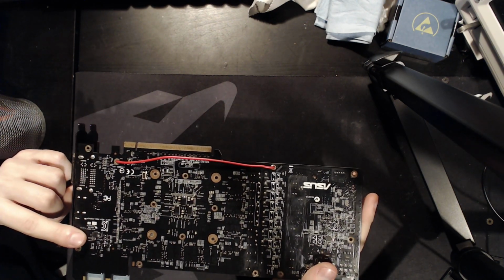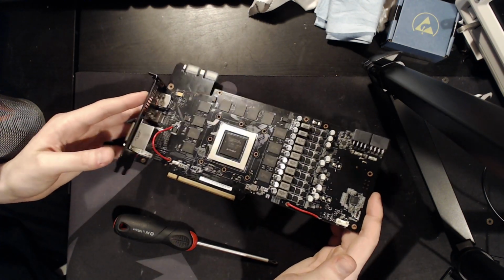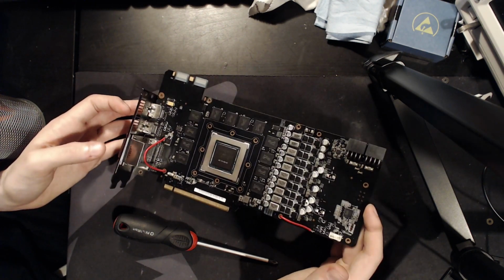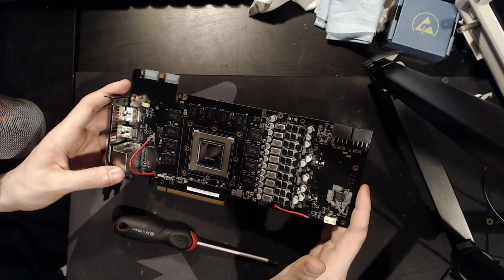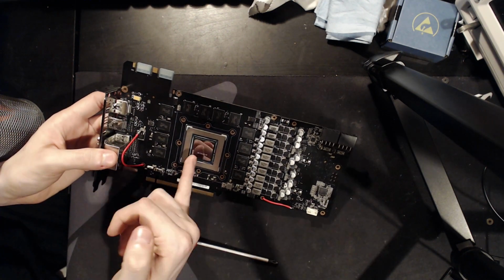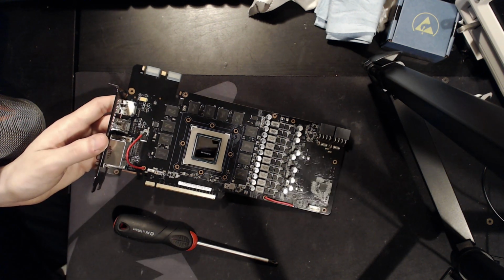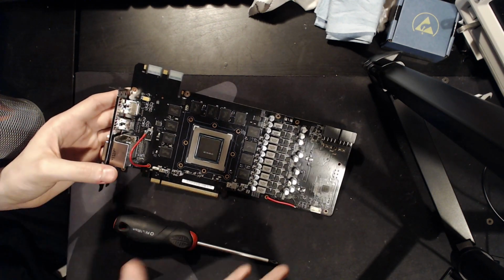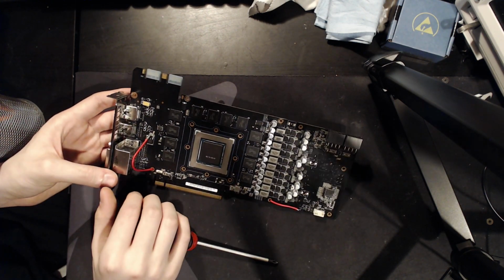I actually think this is probably my first ever repair. Normally what happens is I go buy something that works and then start cramming mods on it until I break it. And when I break things, I don't do repairable style damage. I do the kind of damage where the GPU core got a shot of 2 volts, so the memory controller is destroyed, or the actual core itself is completely destroyed. So there's nothing you can do at that point except buy a different chip, which is not really an option.